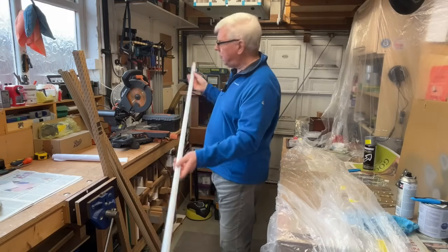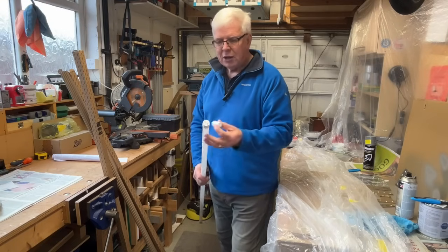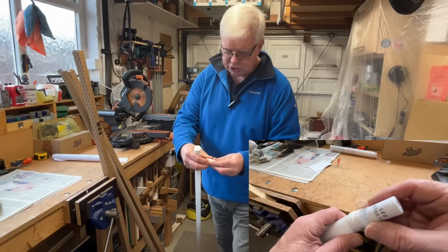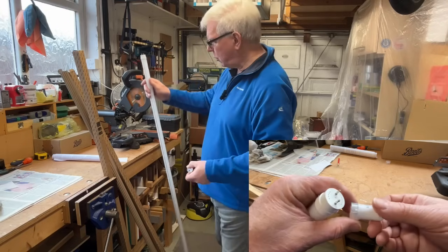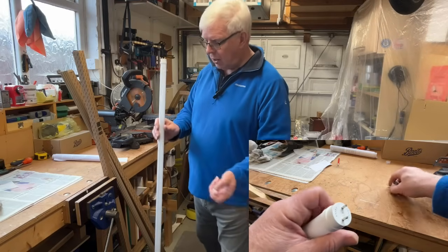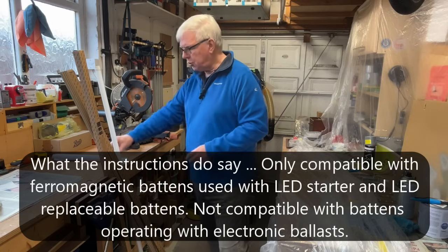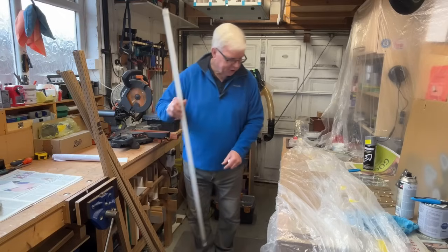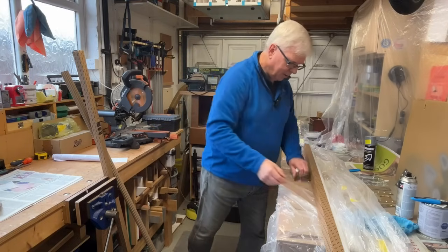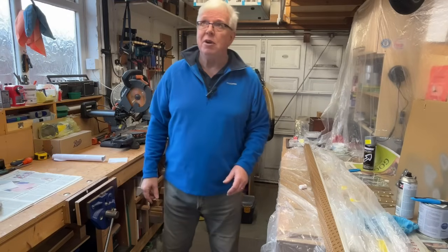You've got the tube itself, and also — I'll do a close-up on this in a moment — you've got what they refer to as an LED starter, which is plugged onto the end of the tube using a little plastic collar that you just have to remove. The important thing to note is you've got to replace the tube and the starter together — they will not work, and might potentially get damaged, with the original starters designed for fluorescent tubes. So it's quite important to know that.